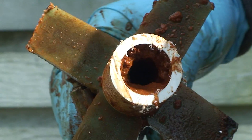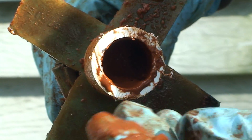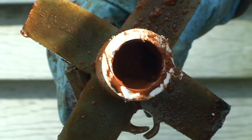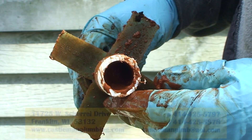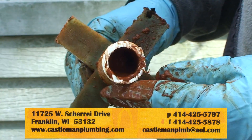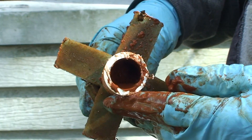The orange mud you see is iron oxide — it's naturally occurring iron in the well, and this is what it looks like. This is what will clog interior piping in the home, especially if we don't have any type of filtration system. At this iron level, we really should have an iron filter and we'll talk to the homeowner about adding that.